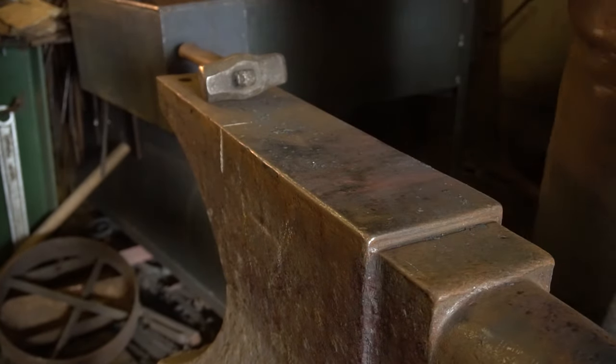The corners are a bit too sharp, so what I'm going to do next is turn the bar slightly — not quite 45 degrees, maybe about 30 degrees — and take some of these corners off and dress those edges in, because nothing worse than having sharp square corners in your fingers. I'm not going to do the whole bar in one heat, just down a little way. The other thing you don't want to be doing is forging in a twist. The bottom's not so important because your fingers don't come into contact with that piece. That's the top end done — now to do the bottom half. Back into the forge, get them nice and straight, and I can leave this on the side of the fire to cool down. That's the rein drawn out — I'm going to let this cool down and forge the other one to make sure it's exactly the same size and length.